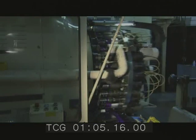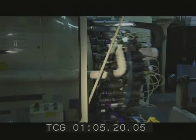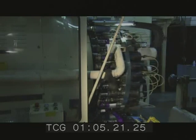So a press crimps the distinctive necks into the aluminum that makes the bottles easier to grip while on the go. As the bottles rotate inside the machine, 15 different steel dies push in the aluminum 1/1000th of an inch at a time to gradually form the bottlenecks.